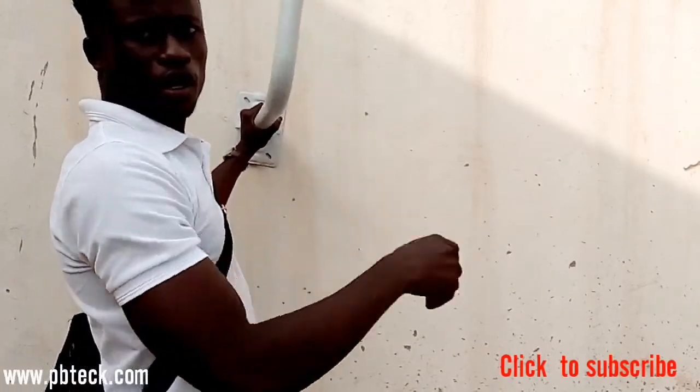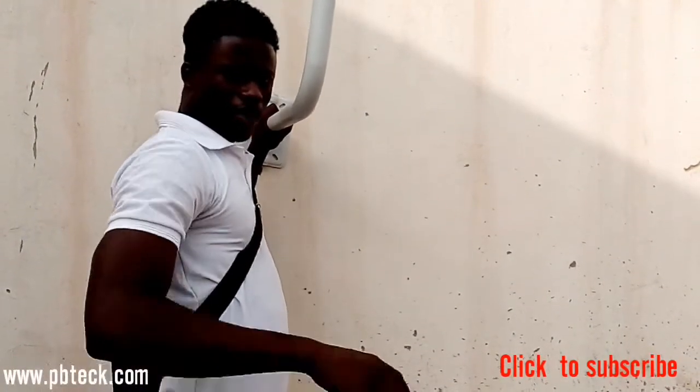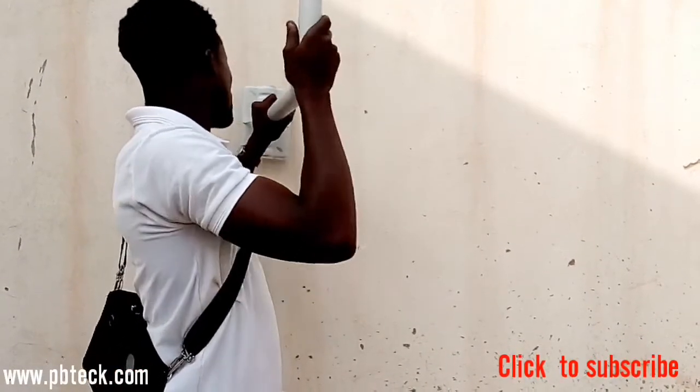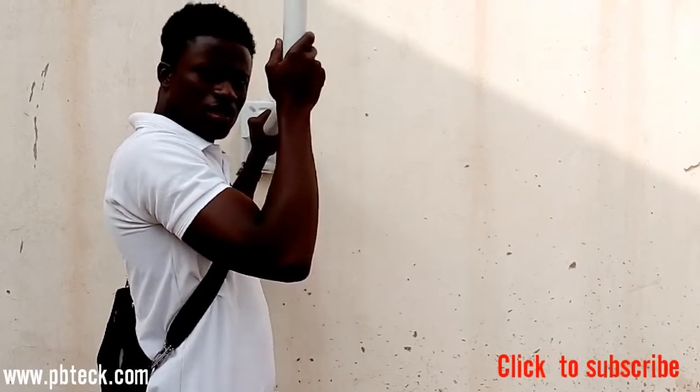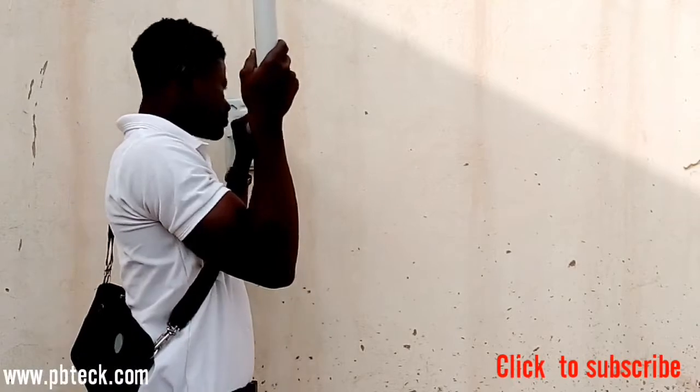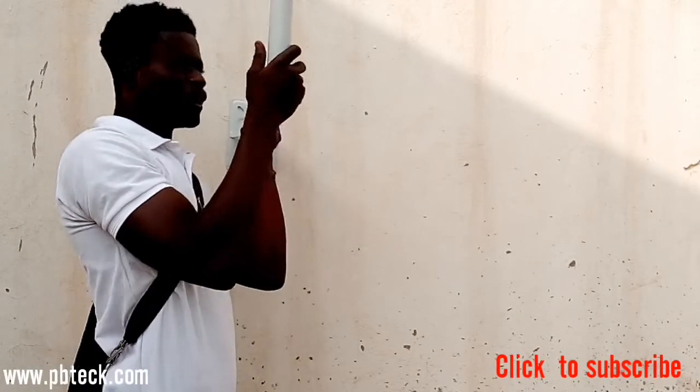You first identify where you will get your signal around your house or any area that you are going to place your dish. So you identify the area which there is no blockages onto the sky. So you place your pole onto the wall like this.